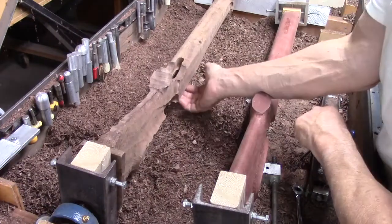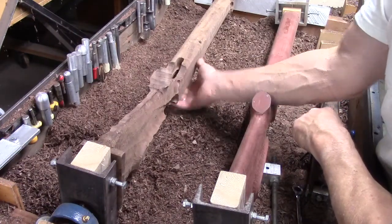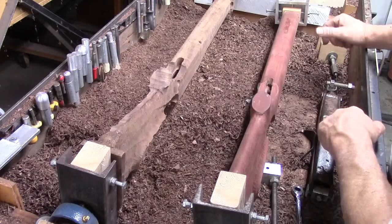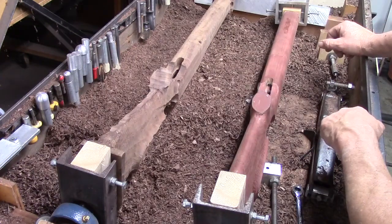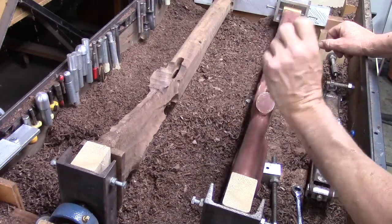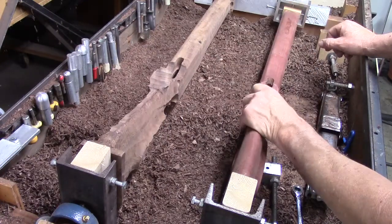I did the trigger slot first so that when I flipped it upside down I could drop into these two and make sure that there wasn't any rotational error. I have had rotational errors in the past. I fought them for many years actually, and just in the last couple of years did a round of improvements on the machine where I found tiny little errors that all collectively added up to make it a little bit of a pain.